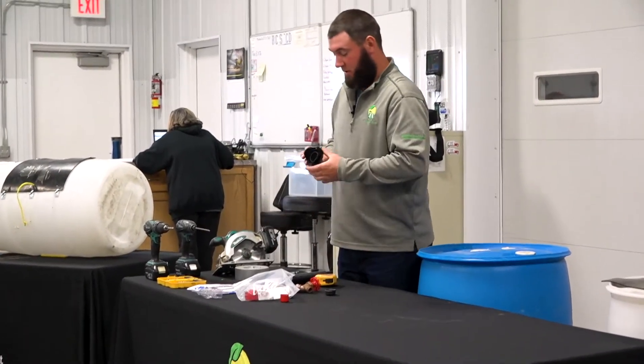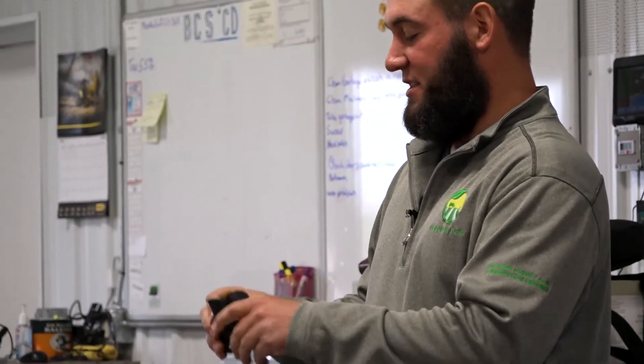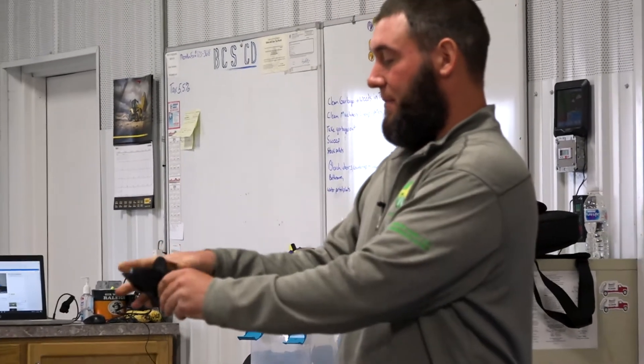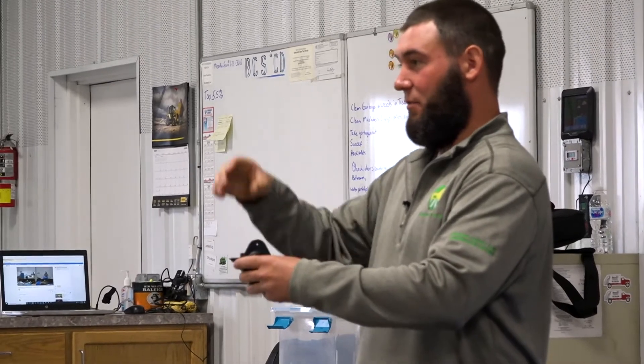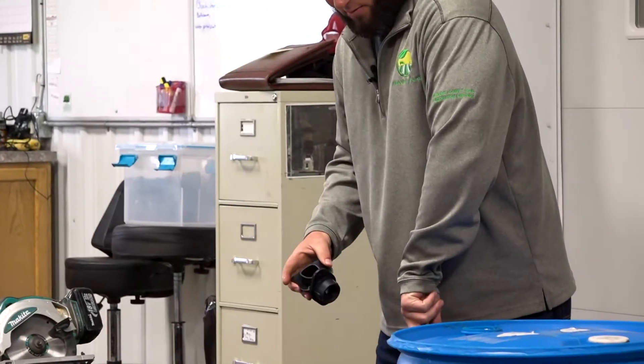When you get home, this is meant for a two-inch by three-inch gutter, which is a standard size gutter. Some are bigger — the ones I have at home are three by four inch. Basically you drill with a large hole saw into the side of your gutter, then you crunch this down and slip it in the hole and it pops out and you can see it'll collect the rainwater. A portion goes through the middle, but this cup catches some of it and then it diverts it — I think this is called the diverter. Then it'll run into this barrel.